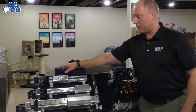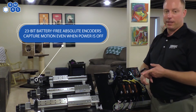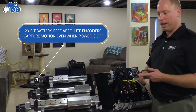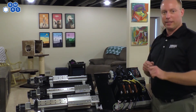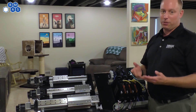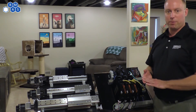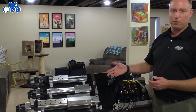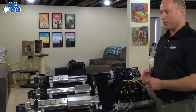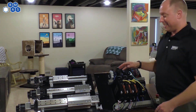On the motors themselves, what we're gonna have is a 23-bit encoder, and that 23-bit encoder provides over 8 million pulse counts per revolution of the motor shaft. So if you can picture going 360 degrees on that one motor shaft and having over 8 million counts in that one rotation — that gives you a lot of accuracy and positioning. But what it's also doing is making things very easy for tuning purposes. The algorithms that Omron has incorporated into the software make it extremely easy. You'll see shortly.